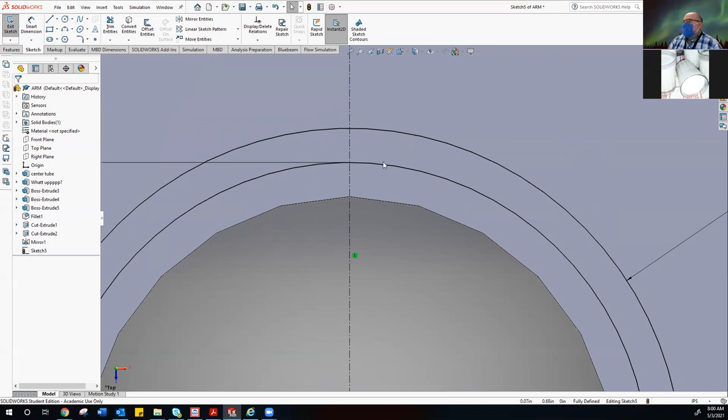Yeah, this must be nine — there's an error on our drawing. This becomes your pitch diametrical pitch circle. In metal gears, perpendicular teeth jam up constantly, so we don't use them. We always want a beveled edge — it helps the teeth fit in and out. Everything we use in the mechanical world derived originally from body systems.